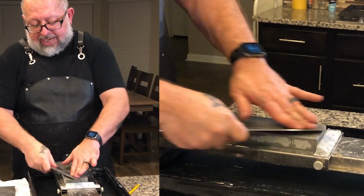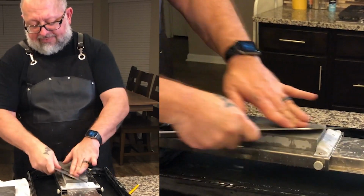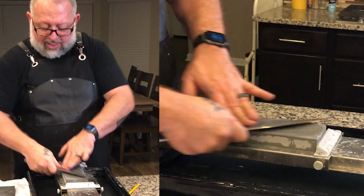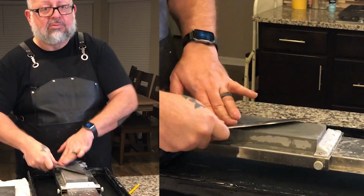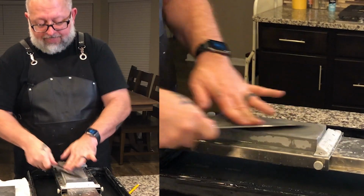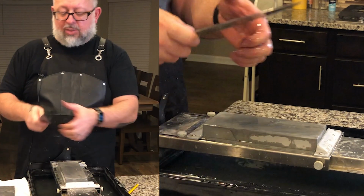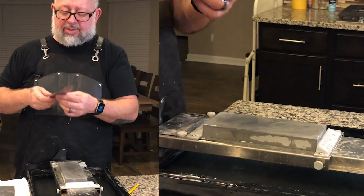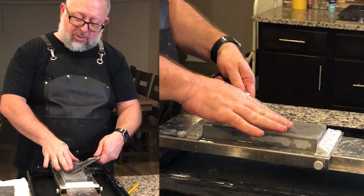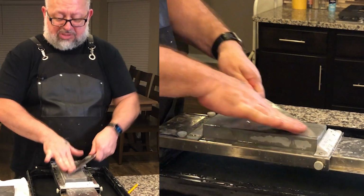And we will have metal shavings off the end of the apex. As I'm rubbing this knife and I'm making a new triangular edge, there is metal that's accumulating on the apex like tassels, like little fringes on your jeans that kind of scrape the asphalt. And those tassels do not come off easily. I'm going to flip them back and forth, and they're just never going to rip off. And eventually, I would even line them up to make a perfect wire edge, which means that these tassels will stand straight up.